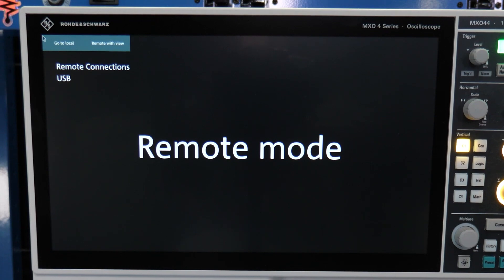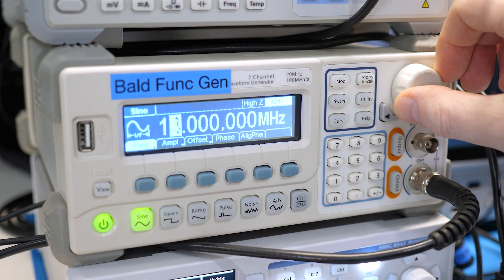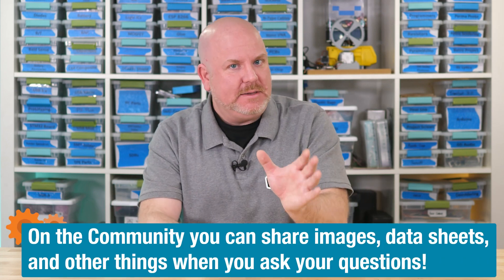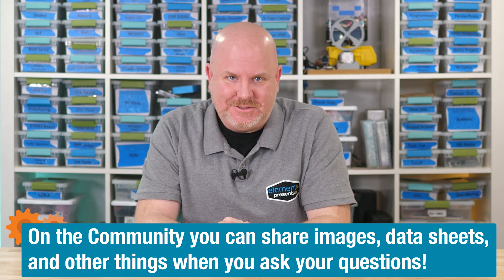Other interfaces like LAN work fine with Windows. Last, most instruments can only operate in local or remote mode. Sometimes they automatically go back to local, sometimes they do not. When they do not, you must press a local button so that the front panel starts working again. Some of those issues might seem frustrating — but that's only because they are. However, once you get connected to the instrument, the issues you run into usually have a clear solution. One place you can get help is the Element 14 community, which is the best place to ask questions because no automation question has a short answer. As always, thank you for watching — now it is time for me to get back to issuing SCPI commands over a VISA driver through an IVI interface on a TCP IP connection to my remote electronics workbench.